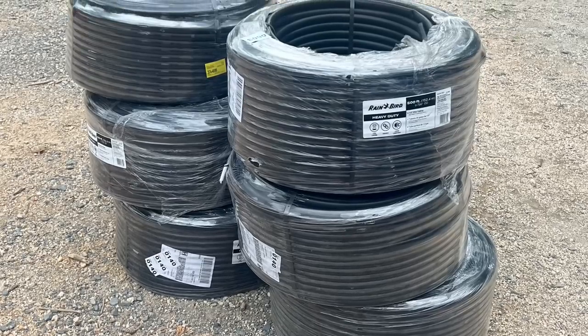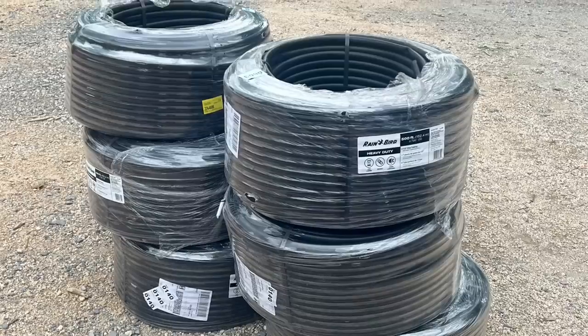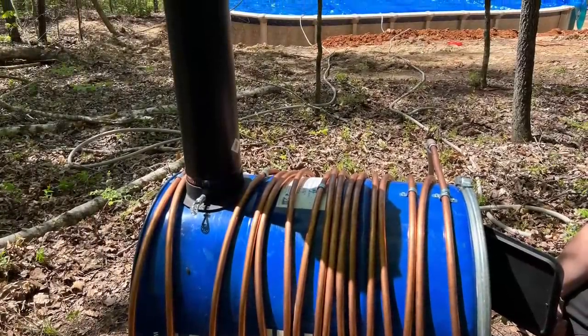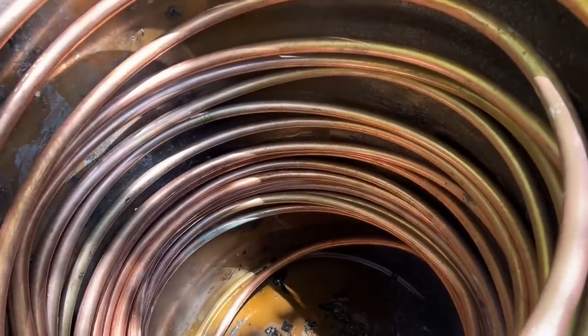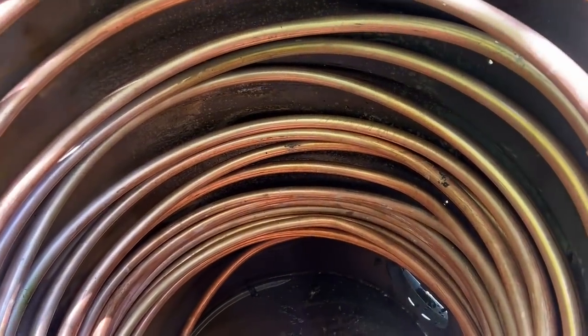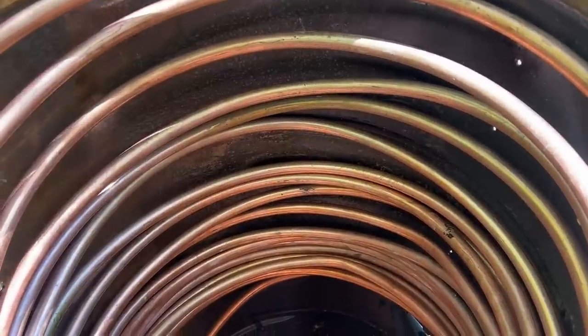I have a solar heater where I have 3,000 feet of half-inch black pipe laid out in the sun to circulate water through it during the daytime. I also have this wood fire pool heater that we're building where we have these copper coils. I started with the coils on the outside and quickly learned there's not nearly as much heat on the outside of the barrel as there is on the inside, so we moved the copper to the inside and that worked much much better. I'm just kind of playing around with the different designs as we go.